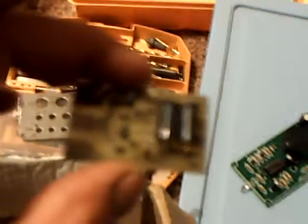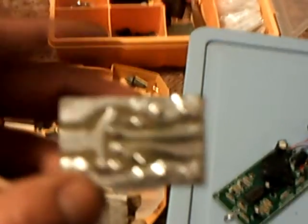There's the 220 plug — it operates on 220. Here's my infrared beam circuit development kit — I got lazy — and that's the receiver. Here's my little MOSFET gate driver circuit: NPN, PNP, and three resistors and some stiffening caps. I made that all by myself. And here's the MOSFET driver board circuit — you can see that's all going up, then you got the AC diagram, the ORI. This is all automation — there's the circuit board design.